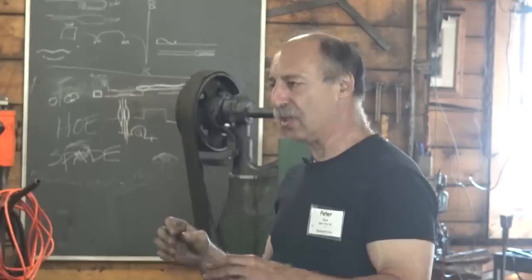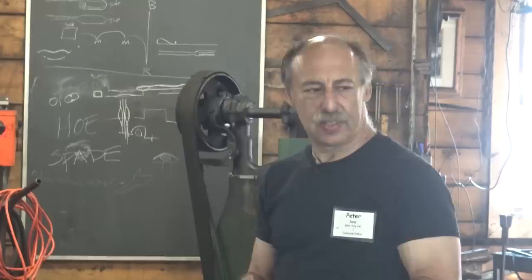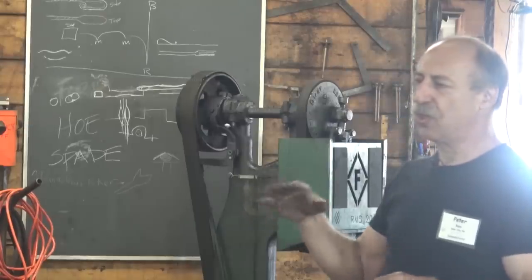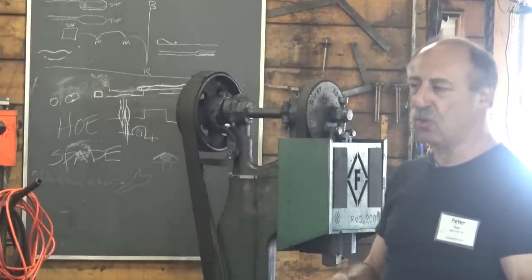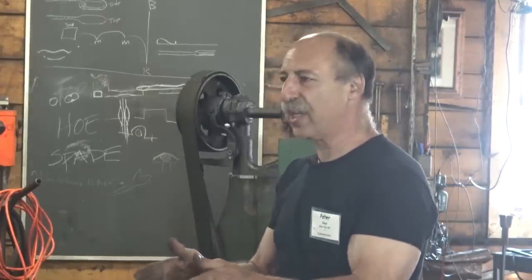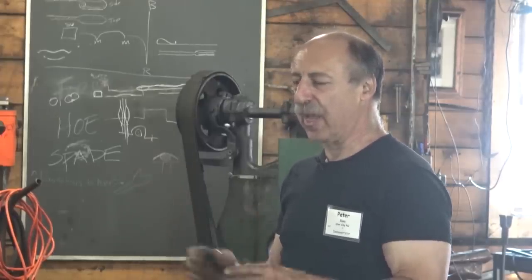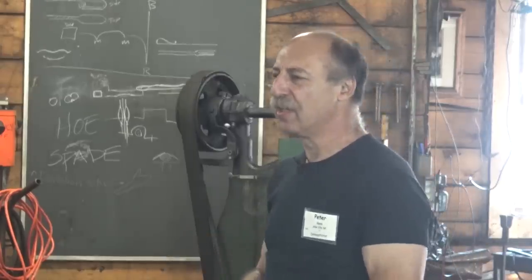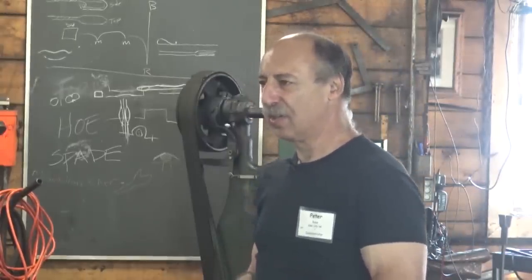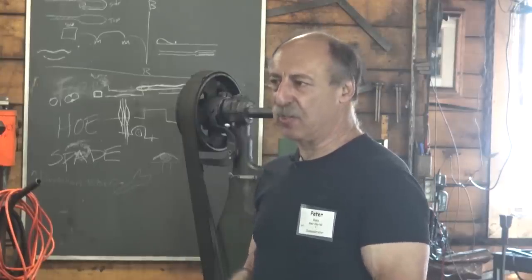That was called blister steel because it actually raised blisters on the surface of the bar. And it's the most uneven. The surface of the bar generally has more carbon than the core. So even if you take any section of that bar, it's going to be uneven throughout its cross section, and maybe uneven along its length as well. Would it penetrate all the way to the center? To some degree. Some would get through. So people knew that was irregular.